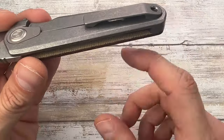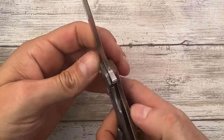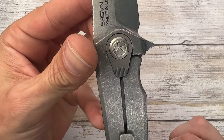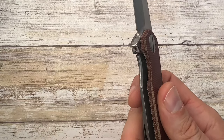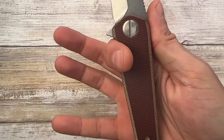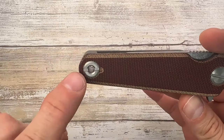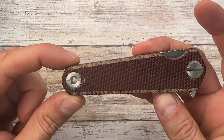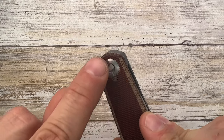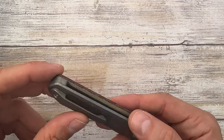There is no internal skeletonization on the micarta, just a little bit going on on the lock side. Notably, in the scales you have a stainless steel lock face insert screwed in from the inside with a blind screw — probably my favorite configuration for the insert to reduce lock stick. You have a nice finger groove that allocates your index finger, and you can take advantage of the jimping there. There's a lanyard hole option — this short backspacer can be used as a lanyard loop. The clip screw goes through the spacer and catches the clip on the other side, making the clip reversible.